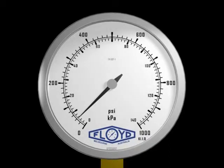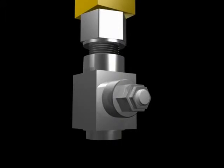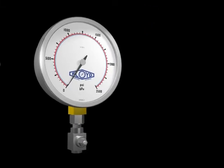In the situation of a pump start-up or a gate valve closing, the gauge could be subject to a spike pressure, and this could be rectified by choosing a higher range gauge, fitting an overload valve or a snubber, to reduce the sudden flow into the gauge.